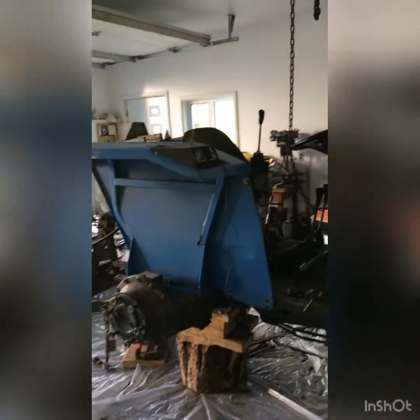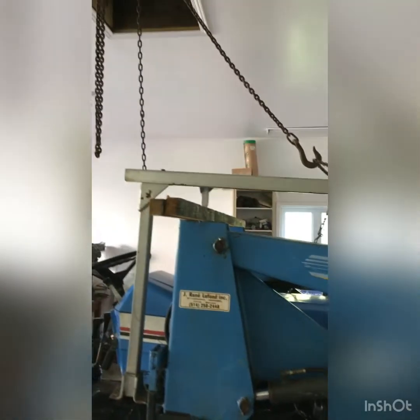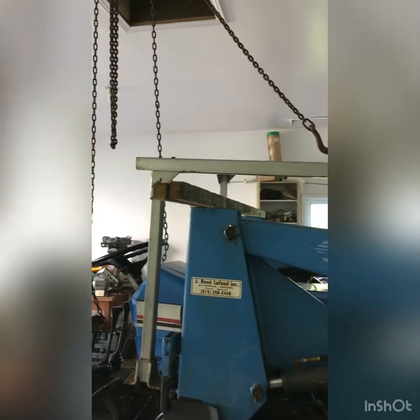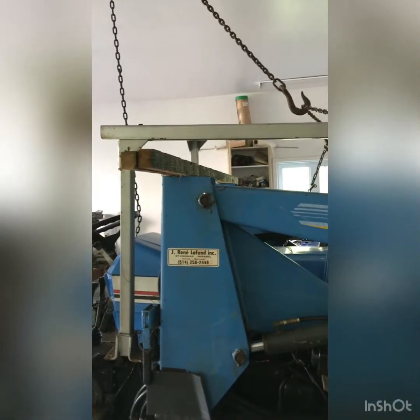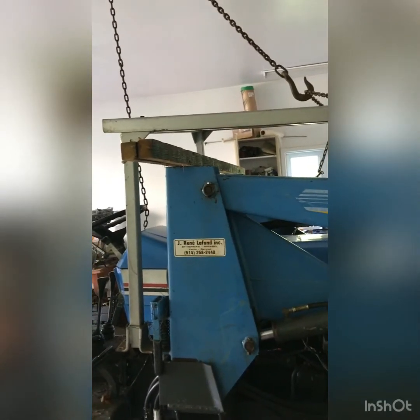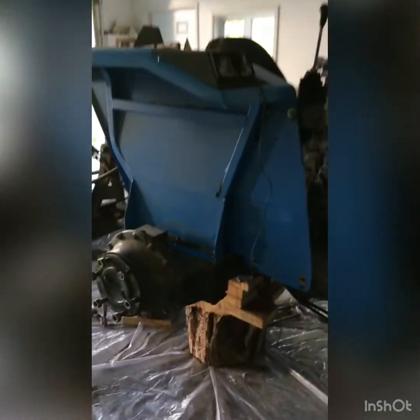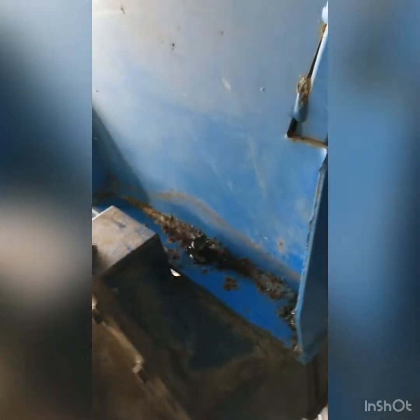Okay, so the first step that we've done was to remove the protector cab. Hopefully we had a winch or a system from the roof to lift that cabin. It was quite heavy. There's a couple of bolts on the fenders, and once this has been done, you have to remove two screws. These screws, 1, 2, 3, and 4, which is behind that. There's no bolt, just the screw right in the fenders.